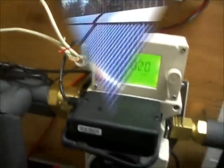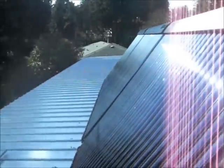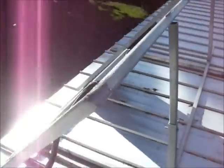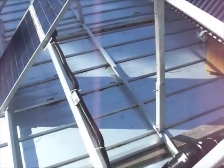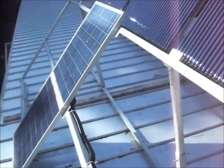It's 20 after 1 in the afternoon Pacific Standard Time and I'm still showing good temperature on the collectors, but we've got a serious shading issue from the cedars here — there are actually three cedar trees. I'll need to get those topped off, and that'll also give me more payback from the PV. I've got four 110-watt panels; the cheapest I've seen now is $259 US from a Richmond BC supplier for each 110-watt panel, which is very reasonable — they used to be $300 or more.